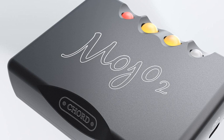Is it borrowed from? There's one in the Hugo 2, isn't there? It's exactly the same as all the crossfeed implementations. Dave, Hugo 2, Hugo 1, the formula, characteristics for it are identical. The coefficient numbers are the same. And the 4 different settings for it are the same. The implementation, of course, is different because it's done through the DSP through biquads, rather than with Hugo 2, it was an individual serial DSP core that I designed to do that function. So the implementation is different, but the mathematics, the coefficients are the same.